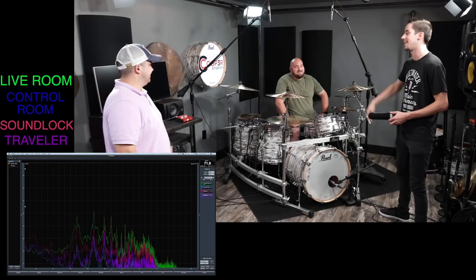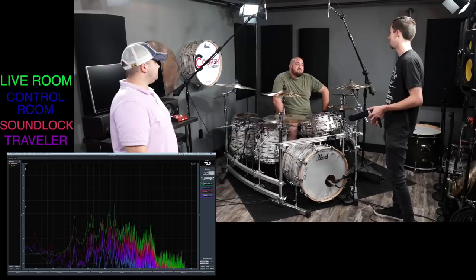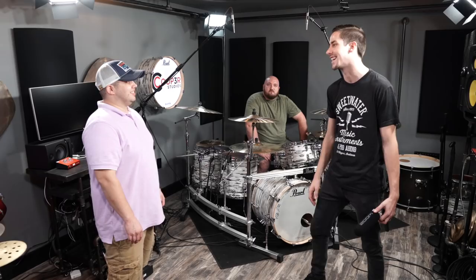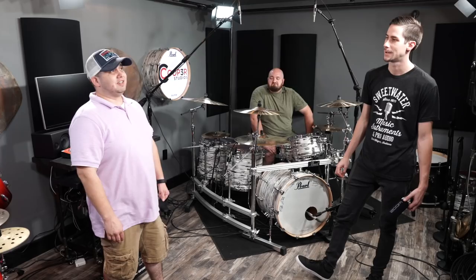It was so cool just being up there and hearing for the first time what it's like for someone to be shredding — playing super hard — and still being able to carry on a conversation. That's a statistical analysis of the actual difference. As I talked about in the soundproofing video, I always put quotes around 'soundproof' because you're really just reducing sound transmission between rooms — the word soundproof is kind of a joke, and acousticians cringe when people say it because it doesn't really exist. The biggest tricks: mass-air-mass. Mass reduces low-frequency transmission, and transmission loss is generally controlled by rigidity, mass, and depth. Build it thick, build it heavy, and leave an air gap.